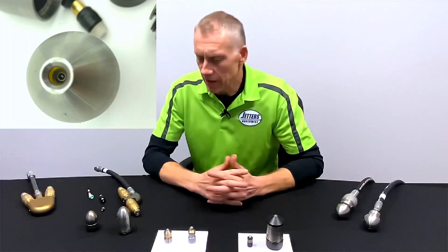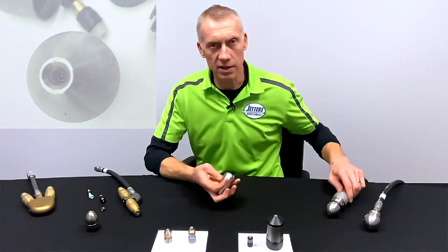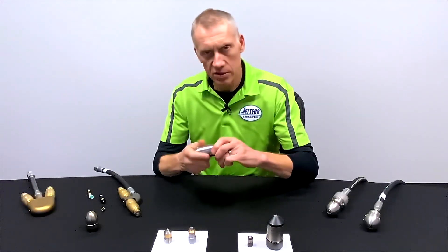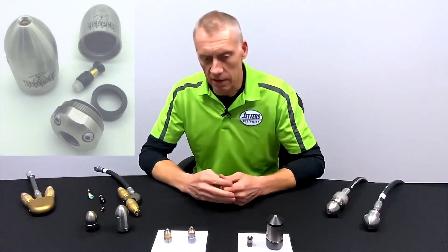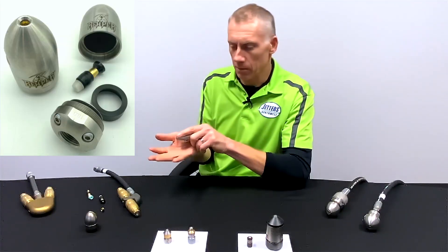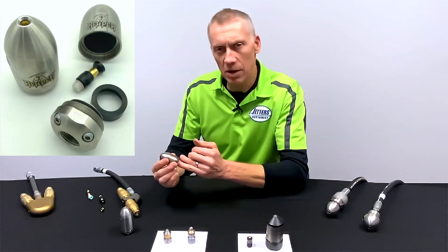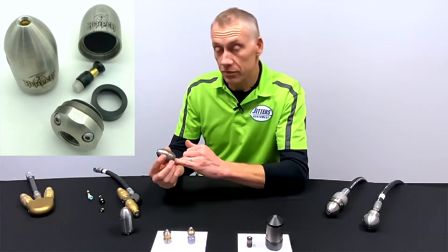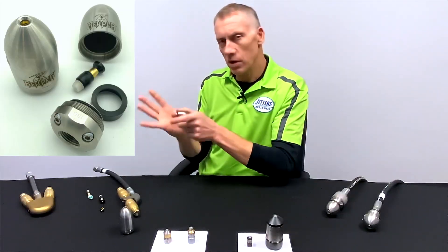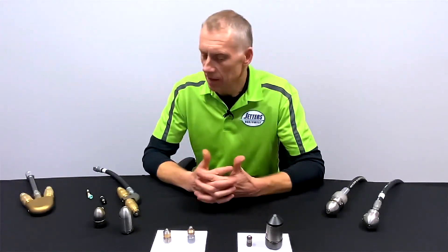The other advantages of internal rotation nozzles: there's no rotating element that will drag on the pipe, so no physical drag to slow the rotation down or cause wear. They're also very easy to disassemble and service — just two-part nozzles and you can access the internal parts really quickly. One more cleaning advantage: that forward cone is wonderful for pushing. Before the Reaper even came out, a customer pointed out that these types are terrific for cleaning grease downstream. That cone out the front can really peel grease and just push it away from the building. Then when the tungsten carbide type like the Reaper came in, they can really, really cut — they've been a game changer.